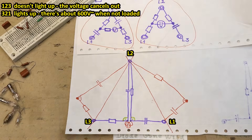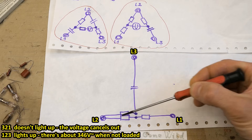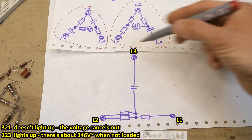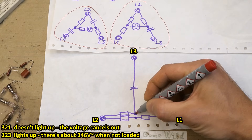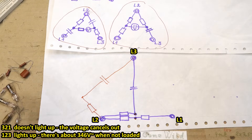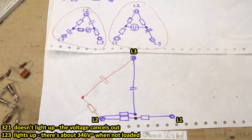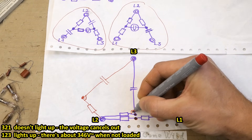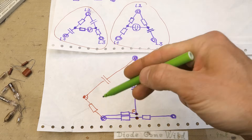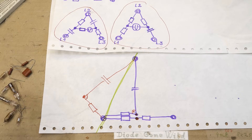Let's explain the simpler version in the same way. That's its graphical representation: two series resistors are on a straight line with voltages at the same phase angle, while the resistor-capacitor circuit has a right angle. In one of the two possible phase sequences, there is virtually no voltage between the two points and the lamp doesn't light up. The other way, there's a significant voltage and the lamp lights up. There is always a 90-degree angle between the capacitor and the resistor — the capacitor voltage is always 90 degrees behind the resistor. When you change the rotation, this RC circuit basically flips around the axis.